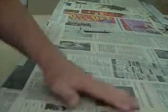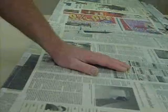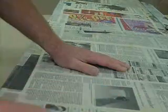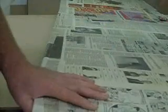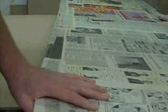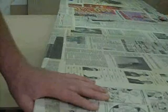I've carefully hand sanded the entire surface, paying attention to where those ridges are. You could have just sanded those ridges off, but what tends to happen is as you're trying to sand them down, you sand too much everywhere else because of the hardness of the glue and end up shaving right through to the foam. You want to be very careful when sanding the edges because, just like working with paint or body work — if you've ever had to sand down a primed area, you know that any edge is going to sand through faster, obviously because it's sticking up more.